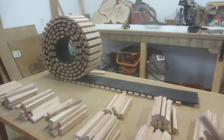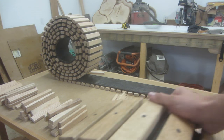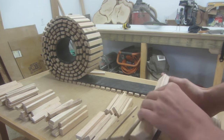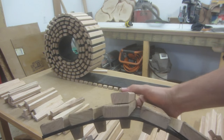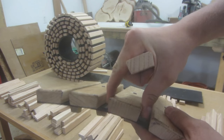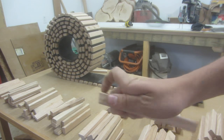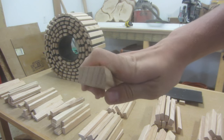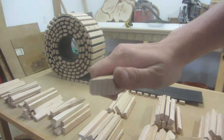I just want to go over the specifications of these track pads. This is the original prototype section of track I made that I showed you earlier. As you can see, the track pads I'm using now are much thinner — these are an inch and seven sixteenths wide as opposed to two inches. Eight inches long, three quarters thick. I cut a taper in there — I think that's 11 degrees. I'll explain why I did that later on.